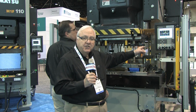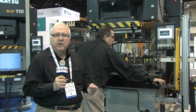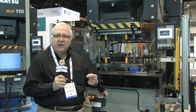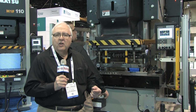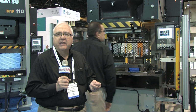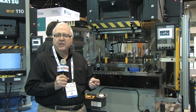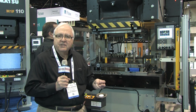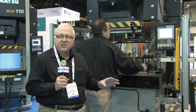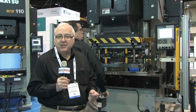The visual inspection system allows you to see exactly what's happening in every stroke of that machine. You get to see not only the tonnage left and right, you also get to see exactly where the machine touches the steel in the production process, shows you its velocity, and shows you the acceleration. So all the guesswork of setup is removed. Digital technology replaces the black magic of the old days.